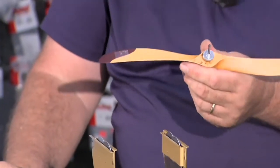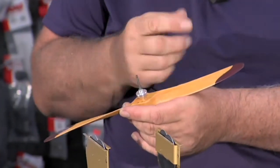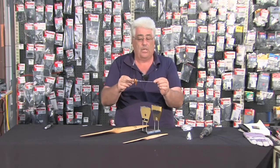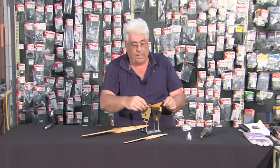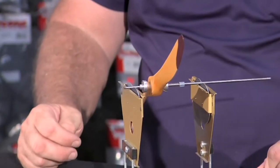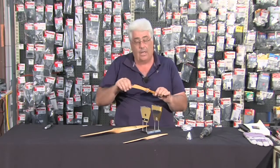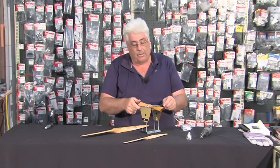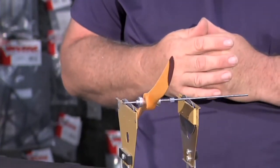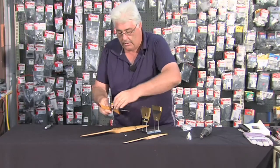You can actually leave that tape on — it's not going anywhere. But another technique I use is to sand the back of the heavier blade just to take material out of it. That's a tip well worth using, and that's how to balance a small propeller blade. I would be more than happy with that as a balance. Remember what I said earlier — once you've used this propeller, the front will become worn, paint will have chipped off, you'll have flies and debris on it. Clean everything off and put it back on the balancer to check. This particular propeller balances perfectly.